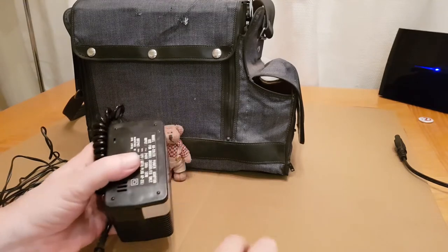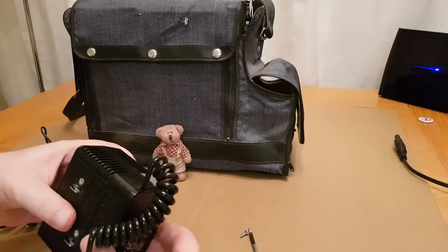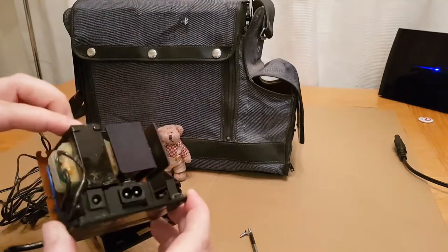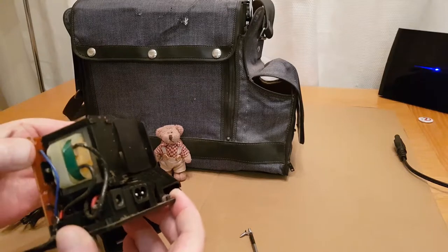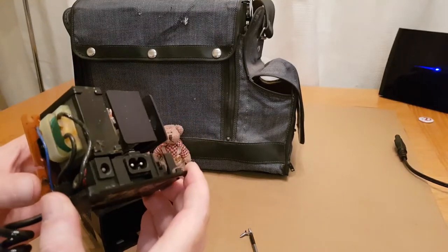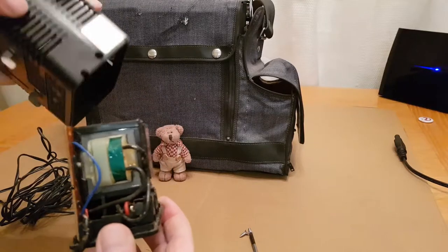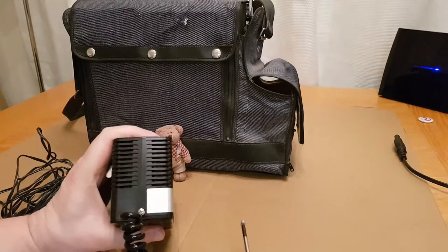Let's undo this screw here. All I did when I tested it was just test the voltage output before connecting it — I just wanted to make sure the right power was going in. It does look like there must be a 9-volt regulator, or a big resistor, to bring down the power. So yeah, it's not a simple straight-through connector.